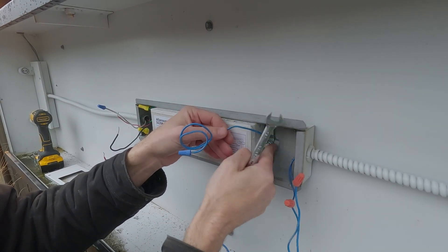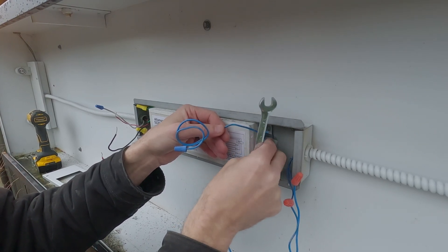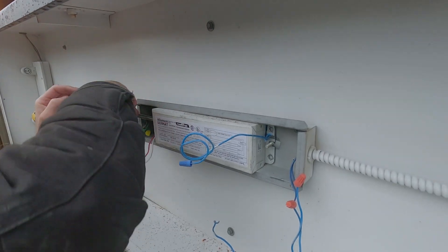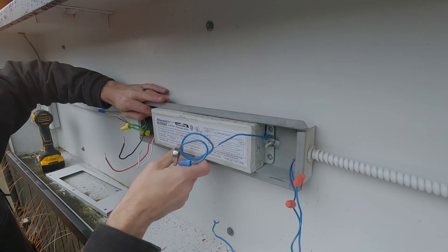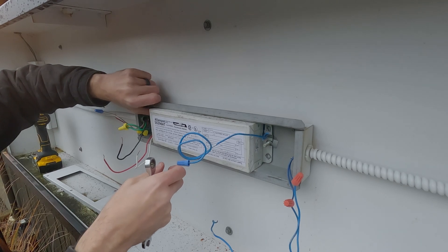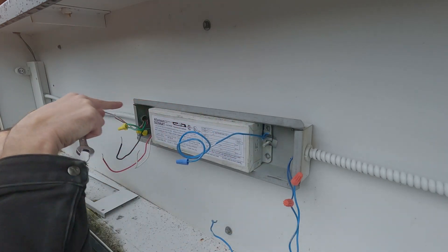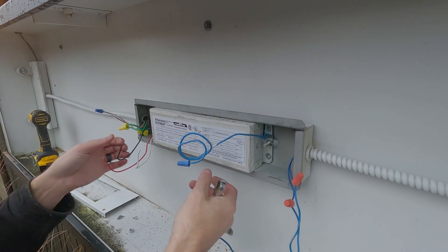It's definitely the trend to take old fluorescent signs like this and turn them into LED signs. I love doing it — it's so easy, and it's just better in the long run. It uses a lot less power. Actually, I'm going to leave the ballast in here — actually, I can't. I've got to take it out. There's nowhere for the wires to pass by the ballast. Normally there'd be a little more room so you can have them come off here and go back that way, but this one's so tight it's going to have to come out.